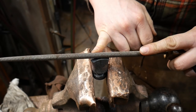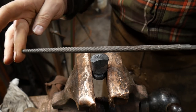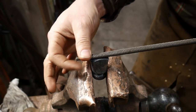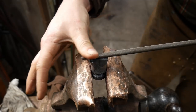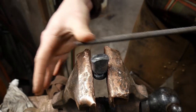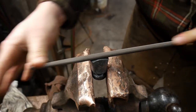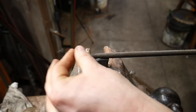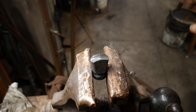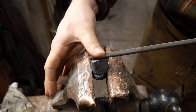I'm using a 3/8-inch round rat-tail file — it's a bastard cut file, roughly about 10 inches long. We're going to take this file in hand, and you can see how it nicely aims right up in the middle. We're going to go ahead and file, keeping our strokes nice and even and going in the same direction. I'm going to file this in nicely, get it started at the high point, and then work it into the rest of the piece. The idea is that this piece will not only form a nice bead for me, but it's also going to push the background away.